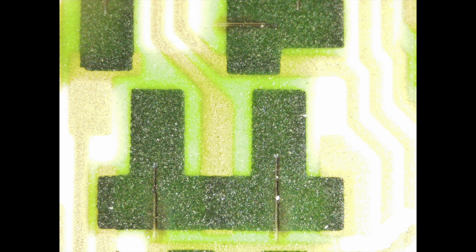That's because they were made with a laser. If you cut into this resistor, the resistance will go up, because the current has to go a longer way. And that's how you adjust those resistors in these hybrid circuits.